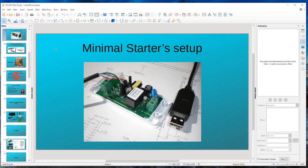Now I could have done it directly, which is what you were suggesting, like with Python, or with Perl, or with Bash, because you can use the MQTT clients, which are just commands in Bash, in shell, and you can send the appropriate commands. I can even use curl. Send it the command, and it will turn on, it will turn off. I can query it for the information.